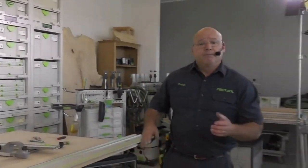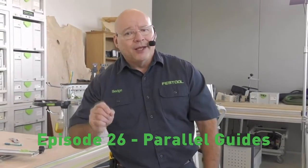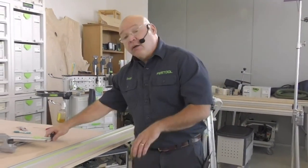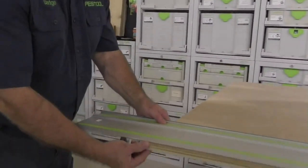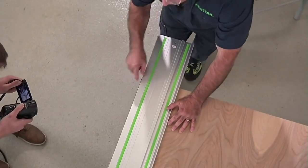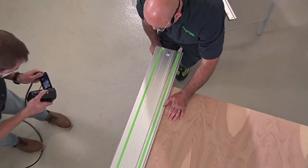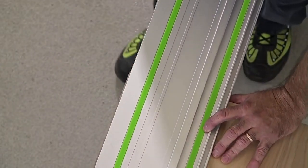What's the first thing you do to a 4x8 piece of plywood? A lot of people don't know this — you have to clean up the factory edge. It's not squaring it; it's getting a straight line rip. The Festool system is great for that. A common question is how much do I take off that rip? I see a lot of people take the splinter guard and put it right there, but you've already cut the splinter guard, and you're not going to get good dust extraction.